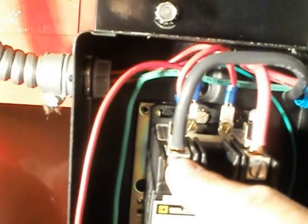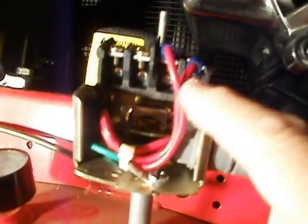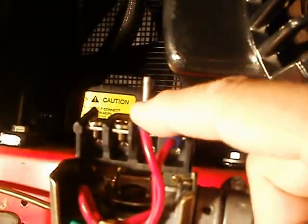Let's follow the order of power here. Follow our black wire right here into the terminal on top. Then from the back side of that terminal, one of the spades has a small red wire which runs off and goes to the pressure switch — it's one of these two wires here. From the pressure switch, we come back with another red wire back through the conduit, and that pressure switch wire lands on one of the coil terminals. It really doesn't matter which coil terminal you land on — the coil is wired completely independent of everything else. It just has two terminals by itself.